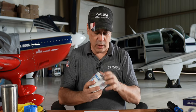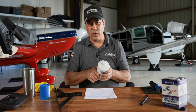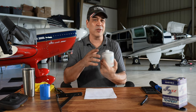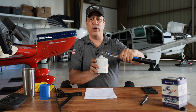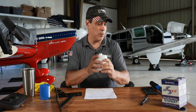One of the last things we want to talk about is when we put the filter on. I had lines on it to help see my quarter turn or three quarter turn. The right thing I was taught — and I said quarter turn in the video, then mentioned some people do three quarters — is: hand tighten it, then with a ratchet go three quarter turn. That's pretty much what a lot of the techs said to me, three quarter turn. I will tell you that I did it, we actually did it on the videos with three quarter turn, then I went and put the torque wrench on it and it still went another half a turn before I got to 16 pounds. So I just use a torque wrench because I don't do this every day.